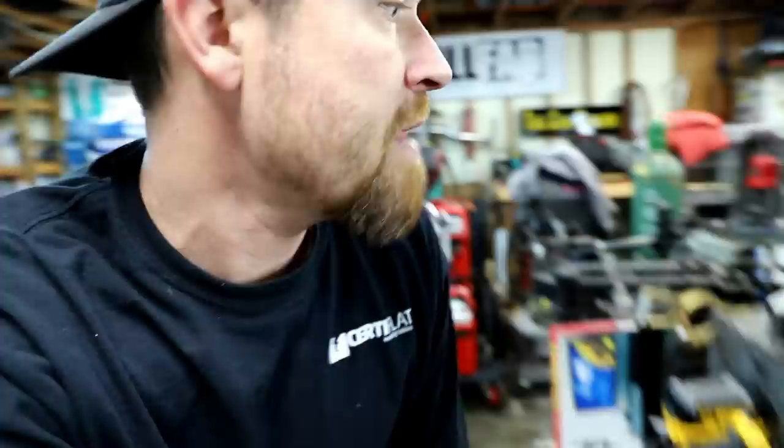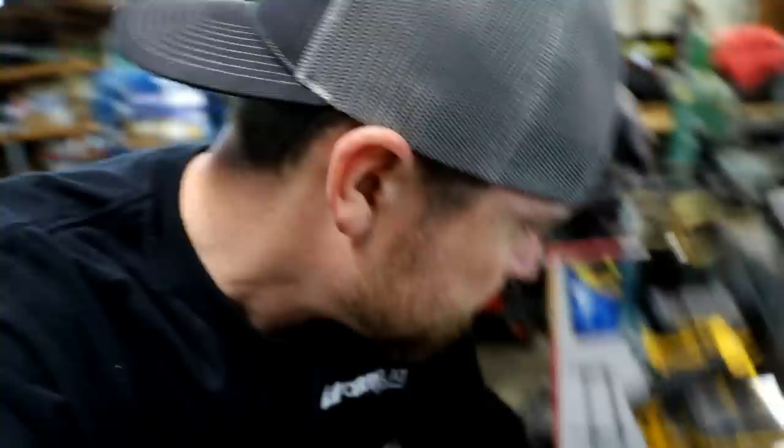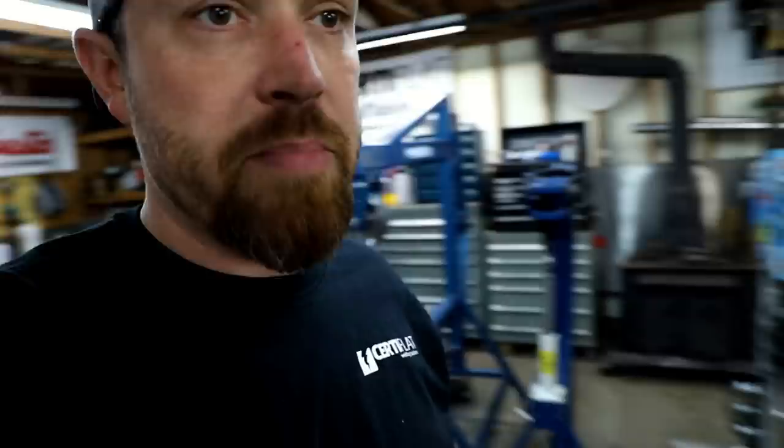The problem is when you start trying to stretch with a standard dome die. They do make linear stretching dies — this one has some crown to it but it's definitely longer than it is wide, and that will stretch metal. It focuses all the energy right in the center and causes that metal to stretch. The problem is that because it still has that arc, if you're just doing something very small, all you're gonna get is contact on the very outer edge of that piece of material.